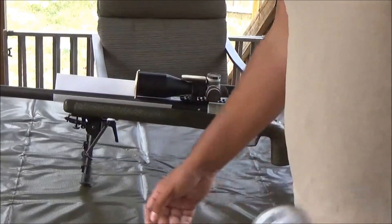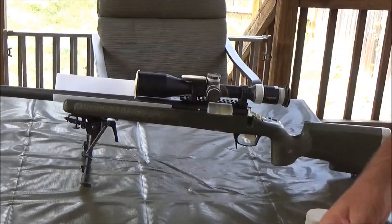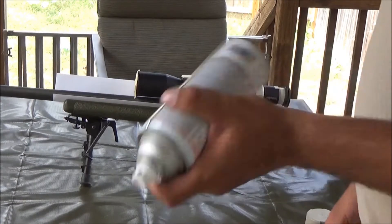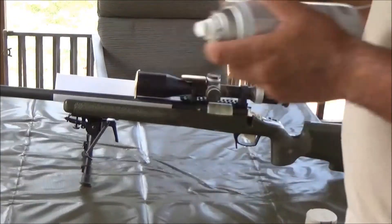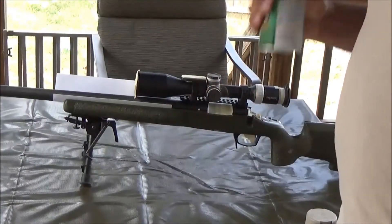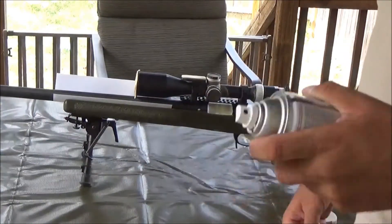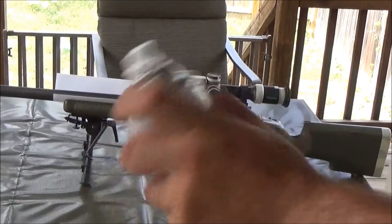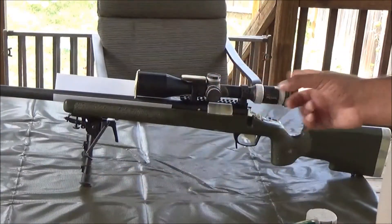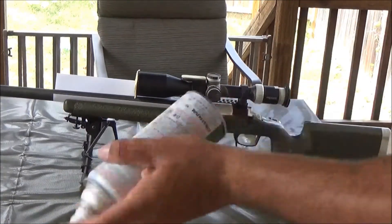For the muzzle, I'll just take a foam ear plug, roll it up until it gets nice and thin, then stick it in the muzzle and it will expand on its own — that covers up your crown so you don't get any paint on your crown or your bore. Keep the spray can about 8 to 12 inches away from the rifle. If it passes all the way across the rifle, you don't want to stop and continue spraying and then turn back because then you're going to have extra thickness at the ends. So here it goes.